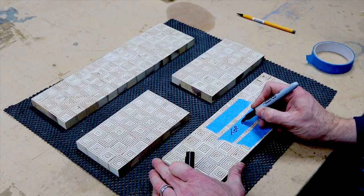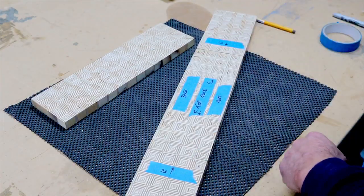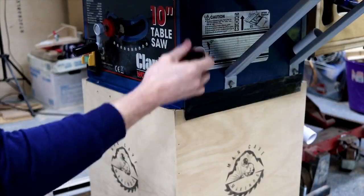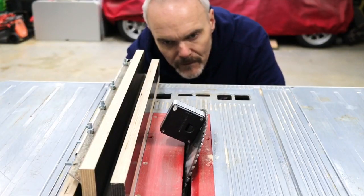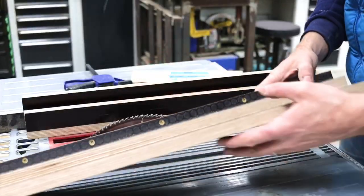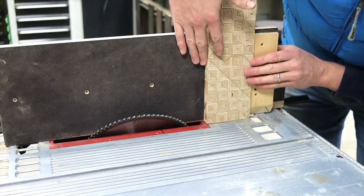To keep myself right and make sure I was cutting the right sides and the right faces, I decided to mark everything up, which was invaluable. Making the trapezoid shape requires you to make a greater-than-45-degree angle cut — in my case it's 62 degrees; in your case it might be something completely different. You definitely need a vertical crosscut sled for this. You're only setting your blade once, leaving it at 62 degrees, and then all you're doing is flipping your reverse cut onto the horizontal and passing it through the blade.